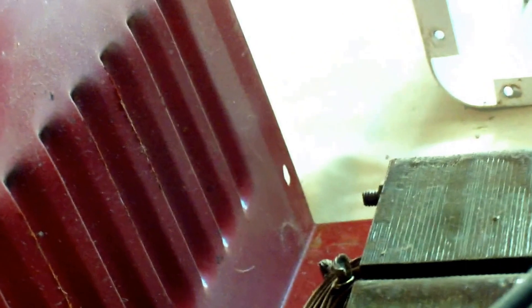So what we're going to do is replace this cord — the AC cord. You can see how it comes right in. AC power comes straight in here to the switch, and then switches to either the six-volt or the 12-volt side of the coil, switching on the main side. This is the other side of that AC. We're going to run our ground off to here and put in a new terminal for that. We can unsolder it there if we want, then run new power leads — they just had them soldered on, so we'll steal that same idea. And this is our output. That's all we've got to do. Pretty simple.